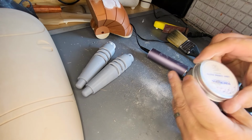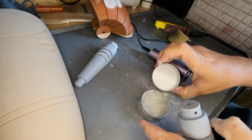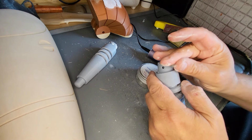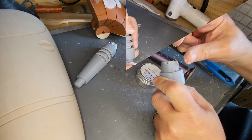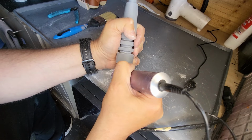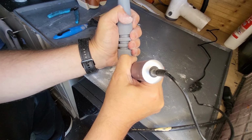I also used some of this UV putty, and I have done a whole video on this which I'll try and link in the description, to fill the holes where I've made sure of course that they are fully drained. I put it on, stuck it in my curing station for about 10 minutes, and that cured it solid, and then you can just sand away. The trouble if you use things like wood filler or some other filler is you have to wait for it to dry. Well, this, as soon as it's cured, it's ready to go, and you're ready then to sand it back out with the foot sander, and it's got that off a dream, no problem at all.